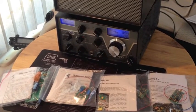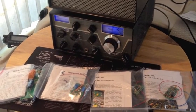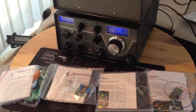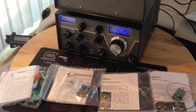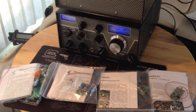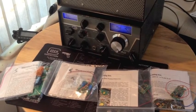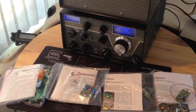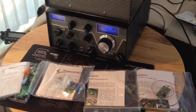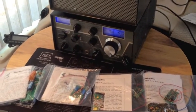The power supply cannot support the original audio chain — it just draws too much current. I think it's a Class A. So you're going to a much more efficient audio driver with the Amp4 system. They kind of need to be put together at once. Then I'm going to put the product detector in, put it all back together, and see how it sounds. Then I'll put in the Mix4, put the radio back together, and show you how that sounds. At least, that's the plan.